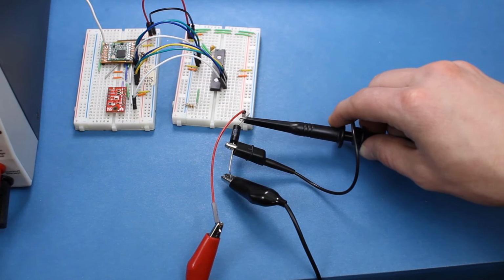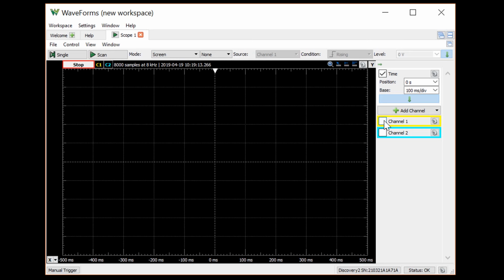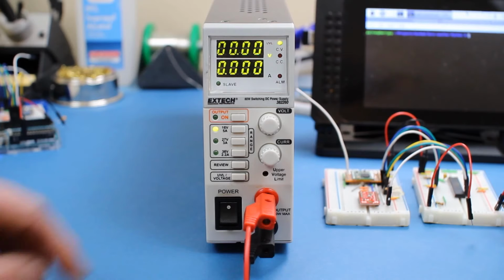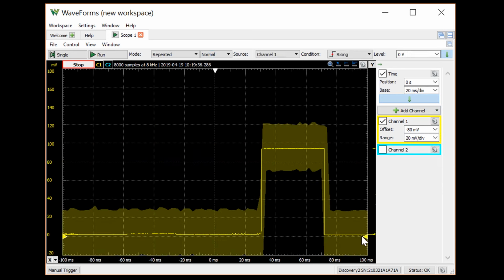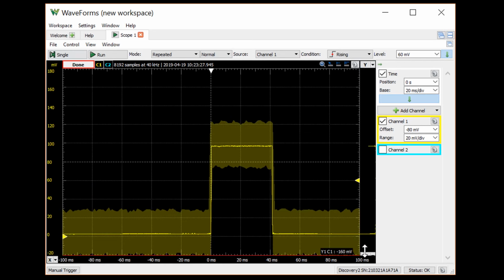I've added the 1 ohm power resistor in series with the return path so we can measure the voltage drop to calculate current draw. It looks like the 328P is resetting again. By adding in the current sense resistor, we're dropping the voltage rail below 1.8 volts when we go to transmit. Let's bump up the operating voltage just a bit again so we can get a steady reading. We likely won't use 2 volts in the end, but we just need to get an idea of how much current we're drawing at this low of a voltage. Besides, a slightly higher voltage means a more conservative estimate anyway.